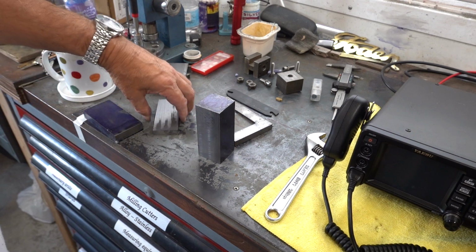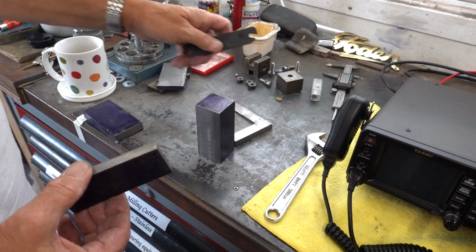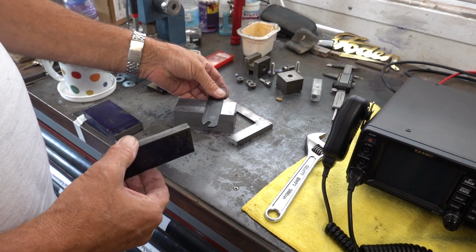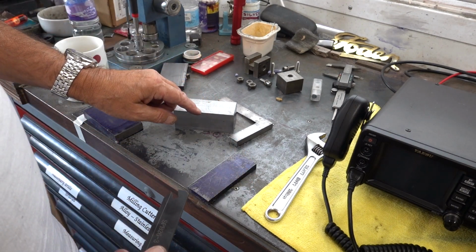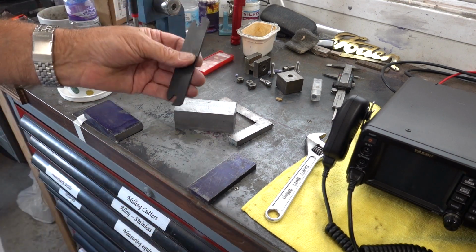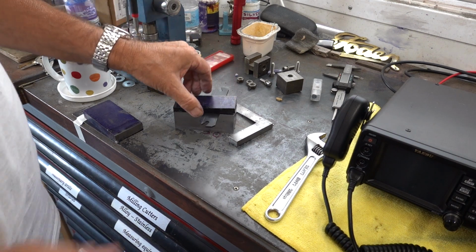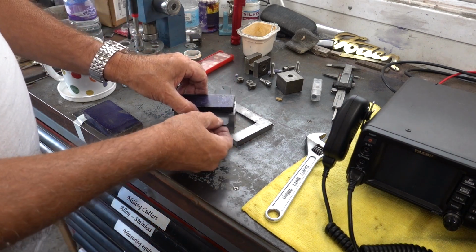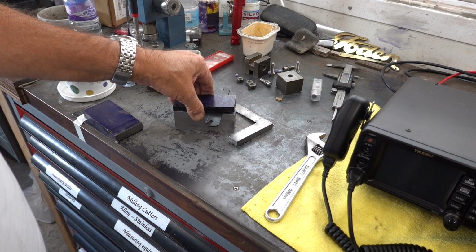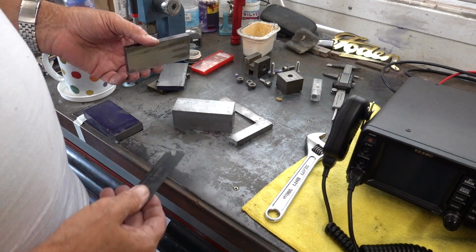But then I've looked at the pieces that I've sliced off, and I think that'll be strong enough to clamp this parting blade into the side of there. My idea was to mill out a slot to accept that, but not quite the depth of the blade, so that this clamp over the top will squeeze it down and stop it moving. It won't be able to slot that way. No. Start again. I've had a million ideas in my head, and this is just one of them. Start again. Right. That's going to stay like that.